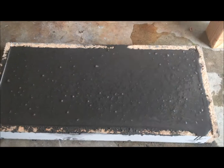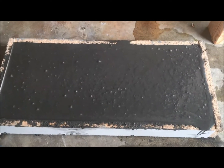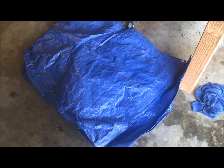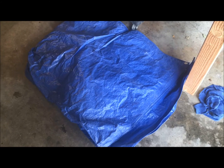I said I'd be back in two or three days, but I left out one very important step. Cover it with a tarp — lay it right over there. Since that's going to be the bottom of it, I don't care if it's touching the concrete, but it should be tented up a little bit so moisture can evaporate. We do this because we want an even cure on the slab. It keeps the moisture in while slowly letting it evaporate out, so hopefully in two or three days most of the moisture is out. Then we'll pop the mold off and get to the fun stuff — sanding the slab to see how it's going to look.